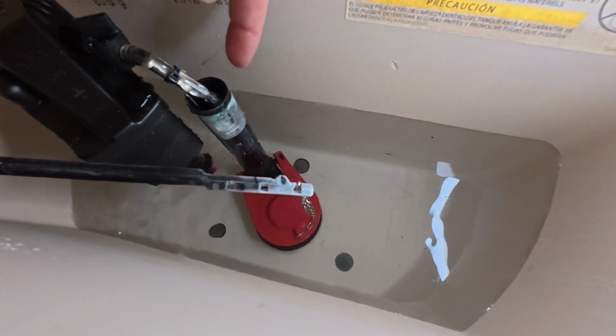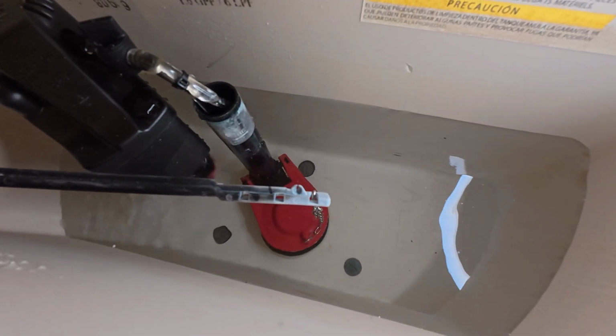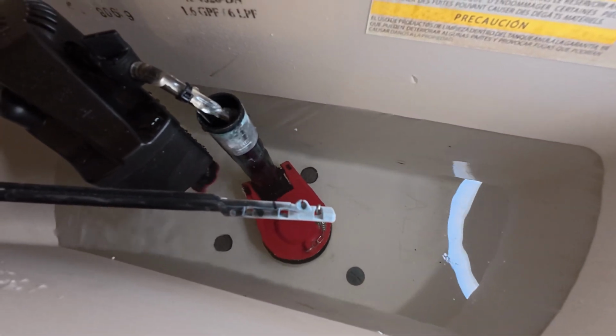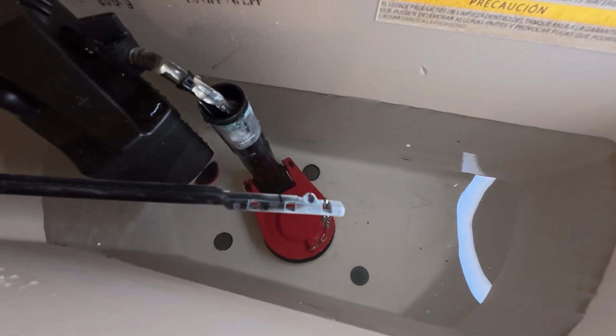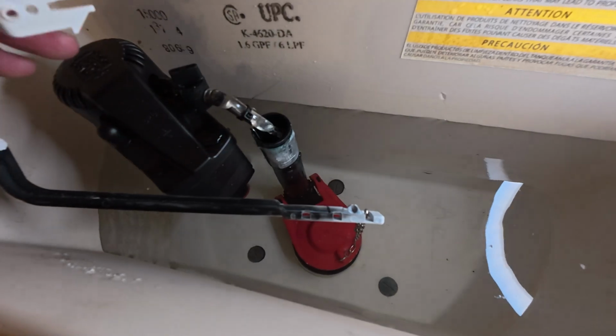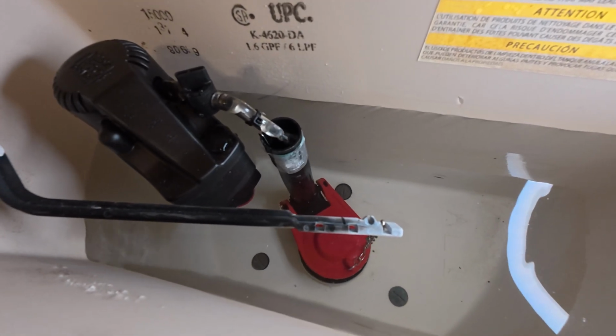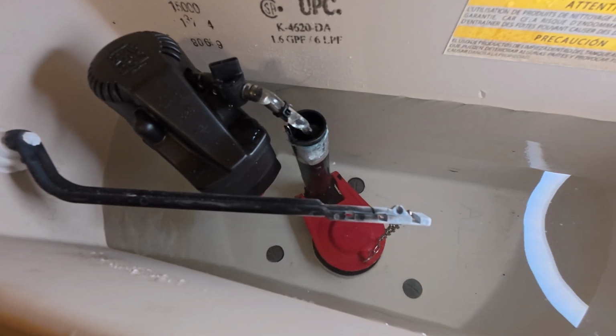So we're looking on my tank to be somewhere right within where this sticker is that was on the original toilet valve. If we're a little bit higher than that, we can adjust this down. And remember that white clip I was telling you about, that's where this comes in, and this thing is adjustable up and down. So we'll still be able to make those adjustments if we're not accurate on where we're at currently.